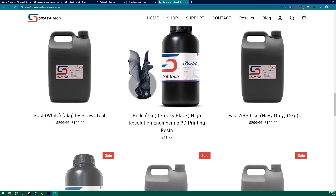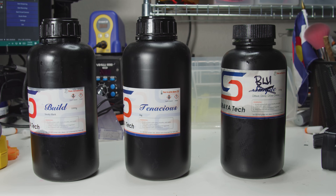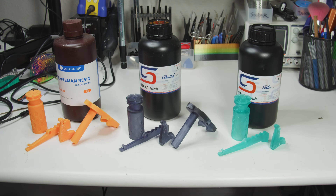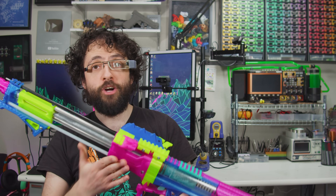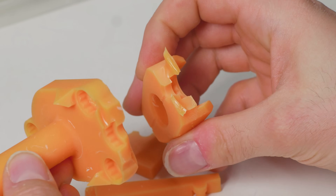Soraya Tech is the finest resin purveyor that would return my calls. They specialize in semi-flexible impact-resistant engineering resins, and our conversation went something like: 'Hello Soraya Tech — I'm going into Nerf battle. I need your strongest resins.' 'My strongest resins are too strong for you, YouTuber.' 'I got 280,000 subscribers. I'm practically a Mr. Beast.' I used each formula to make the Caliburn's most failure-prone parts, installed them, then dry-fired until something broke. As expected, Craftsman resin made brittle prints with prominent warping — C tier. The Soraya Build resin produced crisp corners, smooth surfaces, and tight tolerances, but wasn't much tougher than the Craftsman. B tier for Nerf, A tier for everything else.